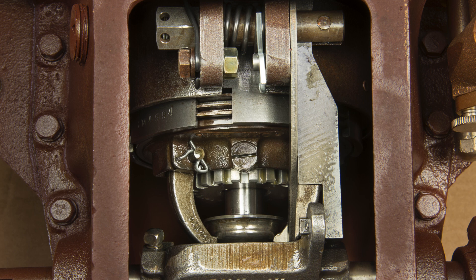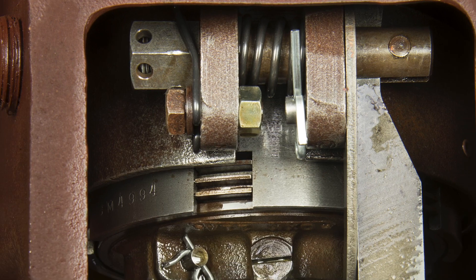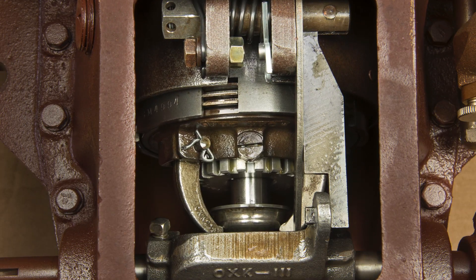How far the shifting lever must be moved aft to stop the rotation of the gear cage — the brake band — can be adjusted by loosening or tightening this 3/4-inch nut on the end of the brake band adjusting bolt. This nut is prevented from turning between adjustments by a small spring clip around the nut, just behind the left ear of the brake band. You can turn this nut inside the spring clip with a 3/4-inch box end wrench, so it is not necessary to ever remove the retaining clip.